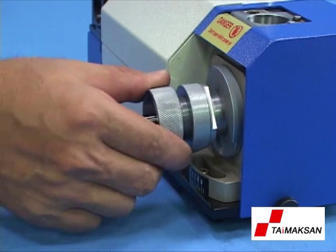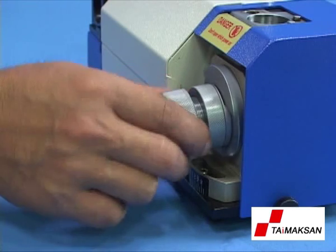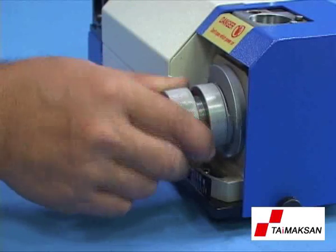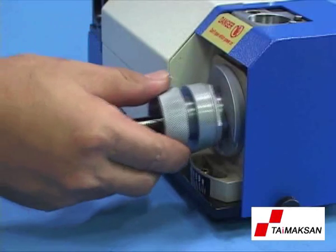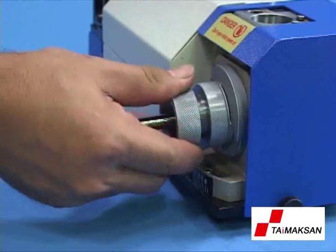Have the drill slightly touch the grinding wheel. Perform slow feed for pressing it to the bottom. Then turn counter-clockwise and clockwise until the grinding sound disappears. Take out the ER collet chuck, rotate it 180 degrees, and repeat the above procedures for repetitive grinding to finish the drill edge grinding.